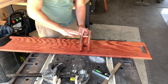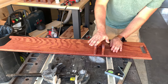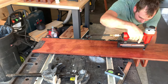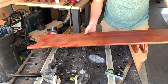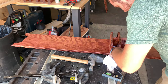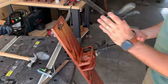As the other side was drying I applied glue to the cup holder and found a spot on the board I liked — about a third from the top — applied some pressure, and then brad nailed it from the backside. I turned it over and hit all the brads down with a hammer to make them flush, wiped out any squeeze out, applied clamps to hold it in place, then wiped out the remaining squeeze out and let it dry for about 20 minutes.